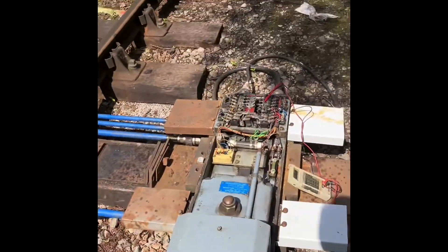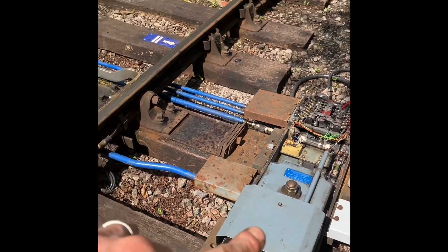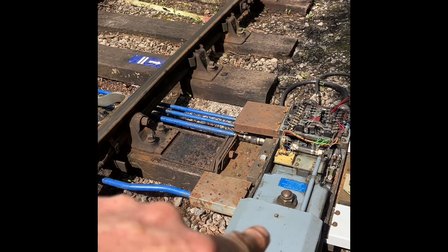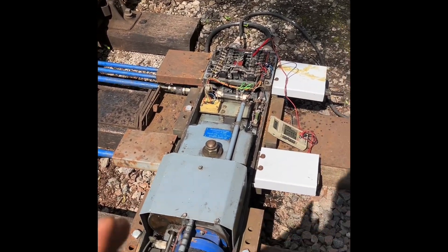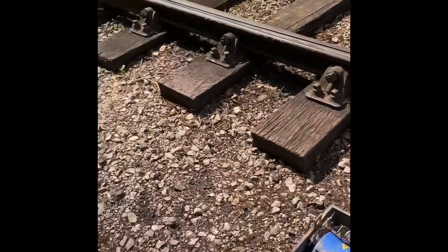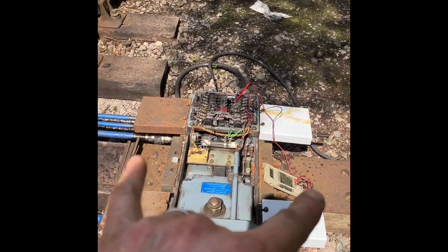Once you've got your machine bolted down — it's 990mm, I think — there's a set measurement of 990 between the inside leading edge and the centre line of the machine. A good way of finding the centre line, apart from the middle of the drive rod, is to go to the lid of the machine where there's a ridge — that ridge is the centre line of the machine. You can use that as your measure. Screw your machine down; you'll notice it's screwed down through the plate, and also on the sole plate at the front to stop it moving.